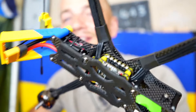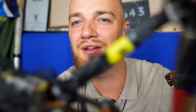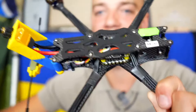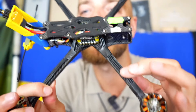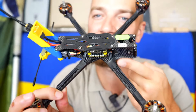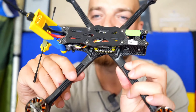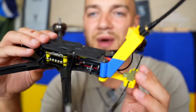Now we bring in this beauty — and I think you can tell which one this is. This is one of our drones. As you can see, all of that wiring is perfectly tied to the frame itself. You look back at the other drone and you just see loose wires sprawled all over. On this masterpiece, we run the wires all the way up. It's very important that we tape the wires to the frame rather than using cable ties — that's to avoid the pressure cutting into the wires, which can affect reliability over time. Then we take the wires inside and connect to the flight controller. You can see the soldering dots there — they are a thing of absolute beauty.